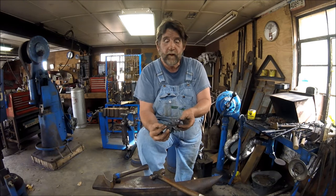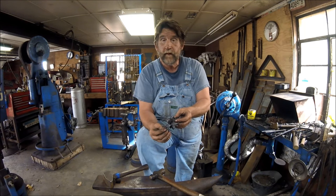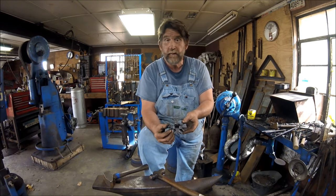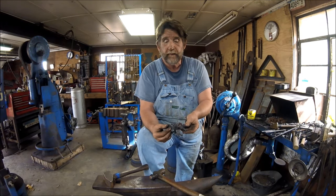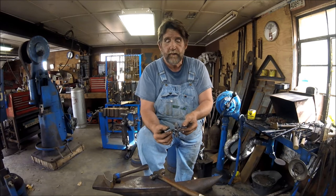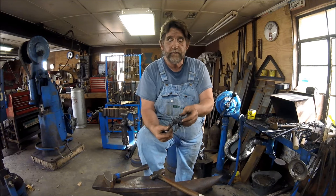The only difference between Michael's way of doing it and mine is he has in there about taking saw blades and putting them in place to keep from closing things up. Personally, I found that to be a little bit more aggravating than it was worth, so I don't do that. And then I open them up with pliers. I don't use anything on the small openings but pliers, and maybe a slitting chisel if I have to, but I find the pliers to be a lot easier to open it up. So that's going to be today's demonstration.